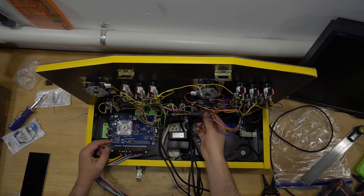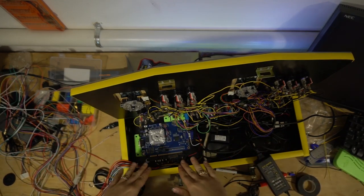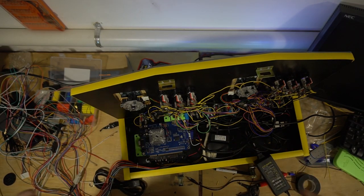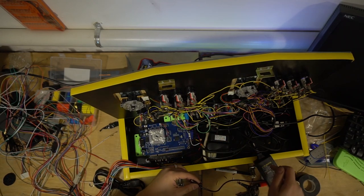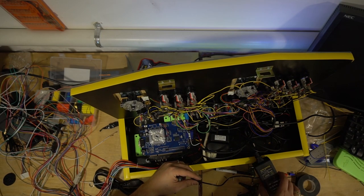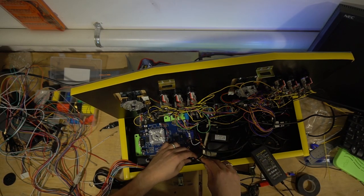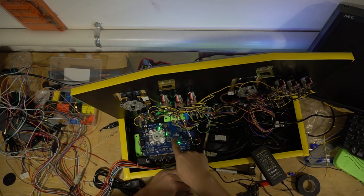The Zinmo will go last and I'll make sure we don't bend anything on that. Quick update on this Pandora's Box - I'm just having bad luck with these JAMA boards lately. I contacted the company and they wanted me to do a couple of tests. We have our power supply at 12 volts, 5 amps, but they believe I might be overpowering it - they require 12 volts, 3 amps. I already ordered a new power supply coming in hopefully tomorrow. I'm going to show you the screen - you can see it's booting up the fans and everything.